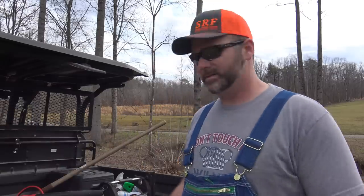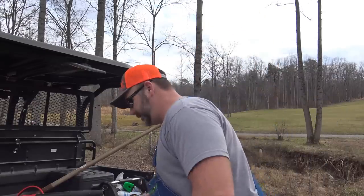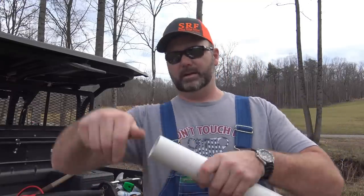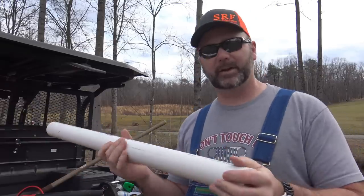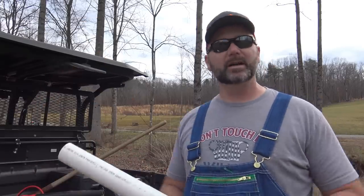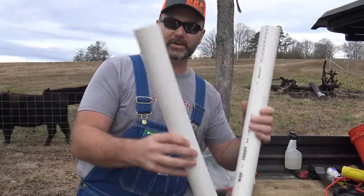We're going to make a homemade filter to keep trash out of our water line. We're using three-quarter inch poly water line because we'll get more flow and the price point is just about right — each roll costs somewhere around $23. We'll take end caps, glue all this together, and make a float. We'll zip tie the float to the poly line and let the filter hang down in the water but not touch the ground. The longer piece makes our float, the shorter one makes our filter.